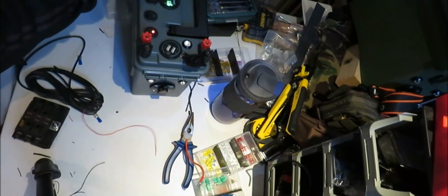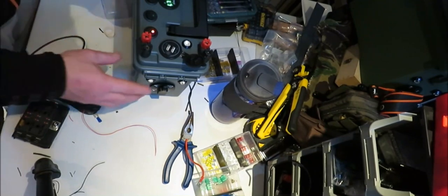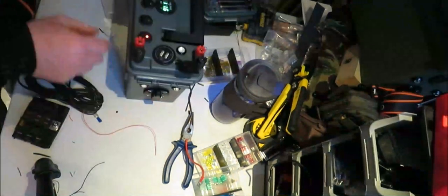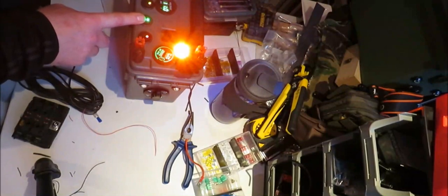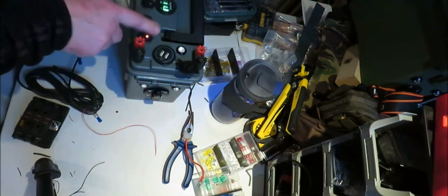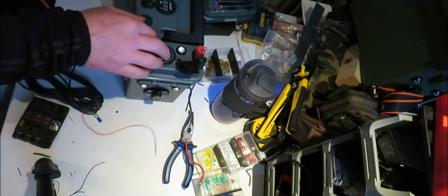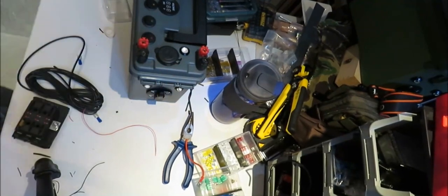That is cigarette. Your jacks. Yeah, hopefully these will work. There you go. Front LEDs. So there you have it. Now I think what's happened there is... No, that's alright. I thought maybe a couple of the fuses would have blown. But the fuse I'm using, majority of the fuses are like 3 amp. So that's plenty. USBs, I would put maybe a 5 amp in. You're drawing more power because you've got two USBs in there. That's it, I'm quite chuffed with that.